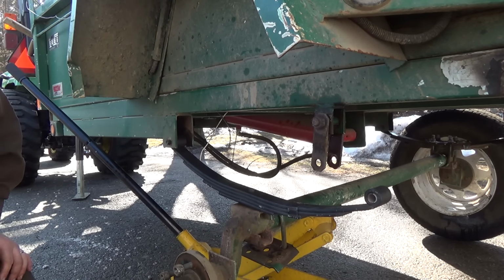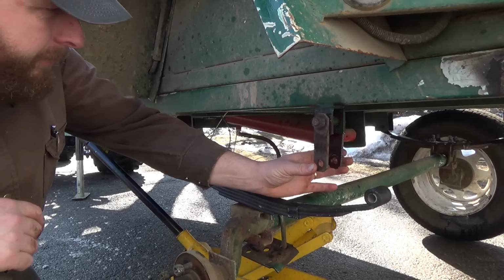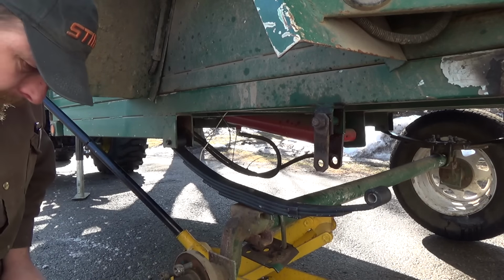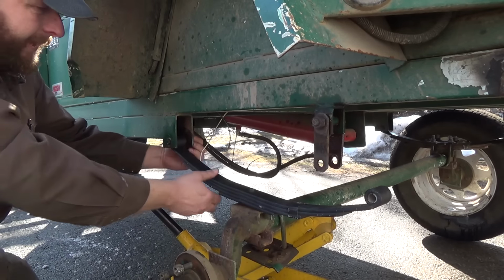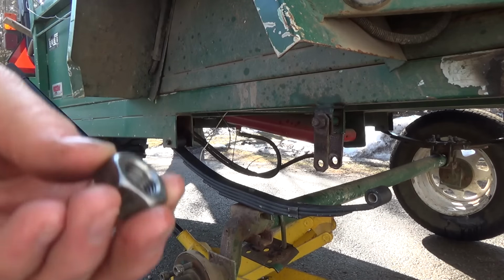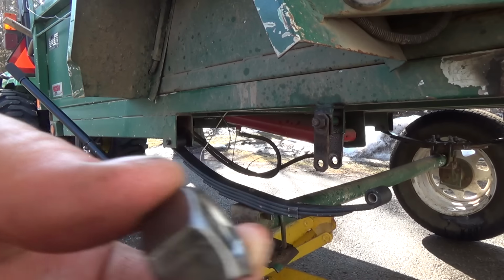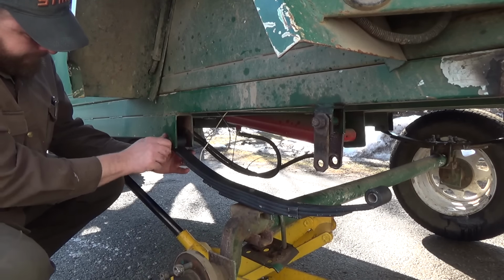So, they're still pretty warm. I'll let those sit a minute maybe. I don't want the heat to transfer through and melt the new plastic bushing in there. So this front one though, we can get him established maybe. Nice new nut. These are like a locky nut. If you look on these, they've got a little bit of a jam thingy there. See, the threads are a little mushed. You'd kind of think that would wreck the threads on the bolts, and it actually might a little bit.